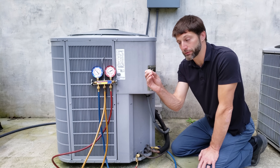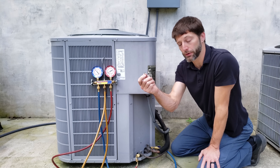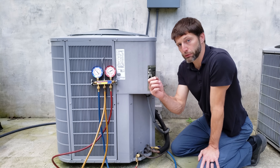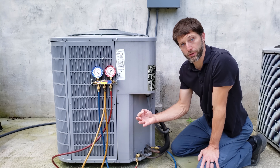Right here I have a little valve core — it's very small — and this is what's stopping the refrigerant from coming out of the system on these types of service valves. So it's very crucial that you're checking the port here and here to see if it's leaking after you're disconnecting.